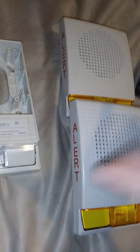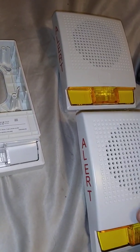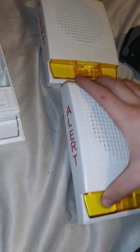So I have both of my speaker strobes out, my G4S7VM's out at the same time too, since it actually is improperly designed like a mass notification device, since it should only be designed like a fire alarm. Since it's already designed like my G4WAS2VMA mass notification speaker strobe, why not have that out too for this video? It would generally be used on a mass notification system, but this specific model says fire. So therefore you would need a mass notification speaker strobe to go on there.